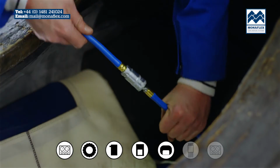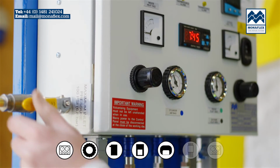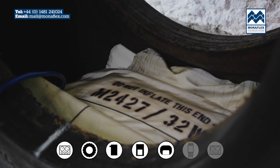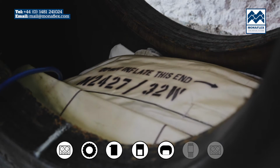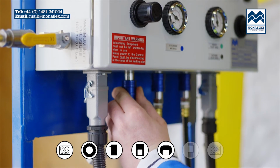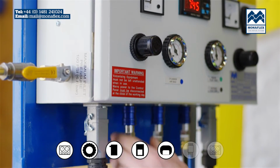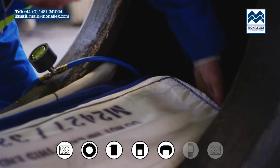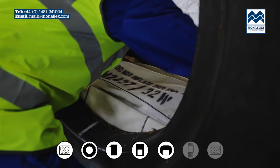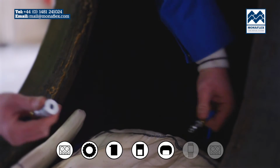Switch the incoming air tap to on and partially inflate the cylinder bag by pulling down the slide valve to form its shape within the tyre. When the shape of the cylinder is starting to appear, stop the air supply and check the positioning of the bag. The airbags and heat pads should all be evenly aligned above the repair, with the top edge of the blue window in line with the bead and facing the sidewall.